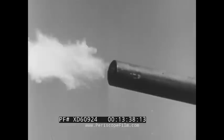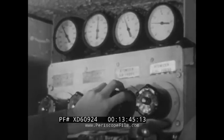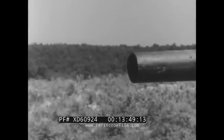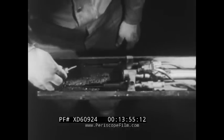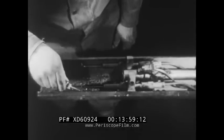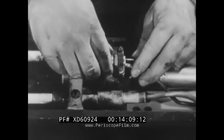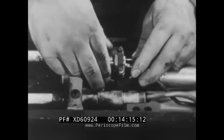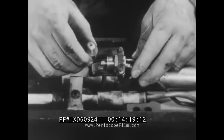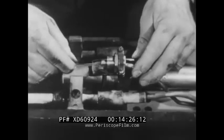Another source of trouble can be in the ignition. Adjust the atomizer air and fuel pressures until you get the proper flame. If there's no ignition flame at all, check these points: the spark gap — it may be too wide or coated with carbon; the plugs may need replacing; or one of the coils may be bad. If everything's okay with the spark plugs and the gun still doesn't fire properly, check the atomizer nozzle — it may be clogged, so clean it out.